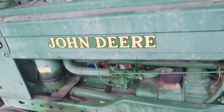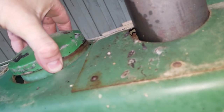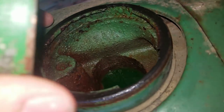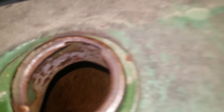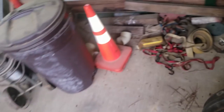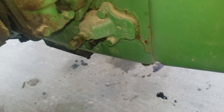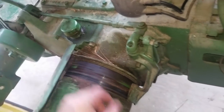A couple of rundown procedures. On old tractors you always want to check to make sure everything's good to go. So this is your radiator cap — you pull it, there it is. We got some cooling in there, antifreeze. Not your go-go juice. Should have plenty. A little rust in the bottom of the tank, never hurt nobody. And to check the oil level, these don't have dipsticks. You actually come over here and take this plug out, pull it out, and you can look in there and see the oil level. That's your fill for your oil — take the cap off, start dumping your fill in.